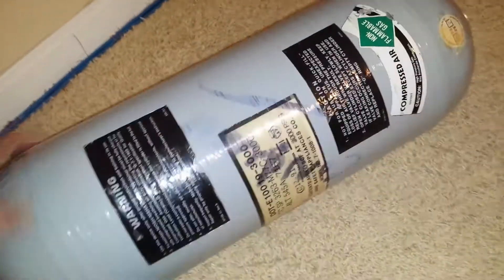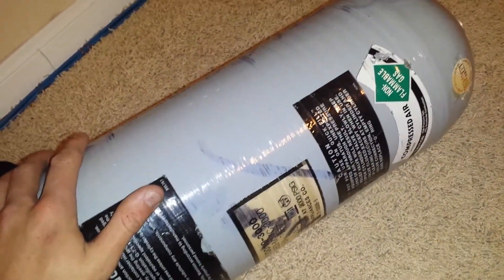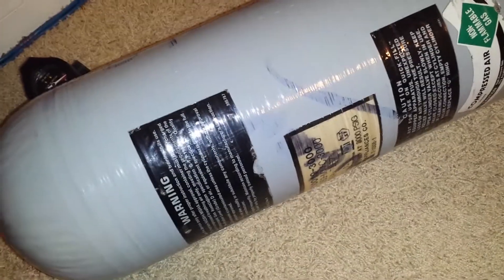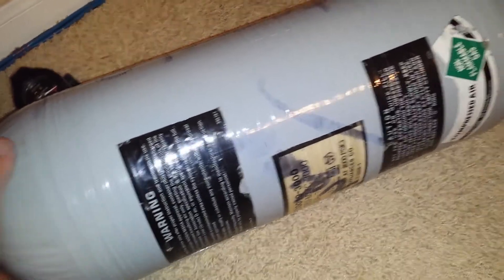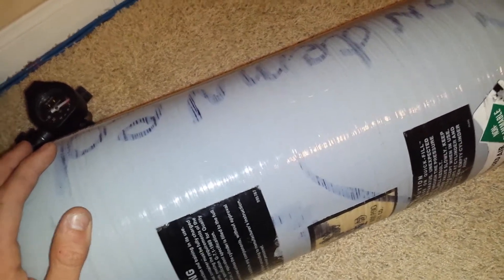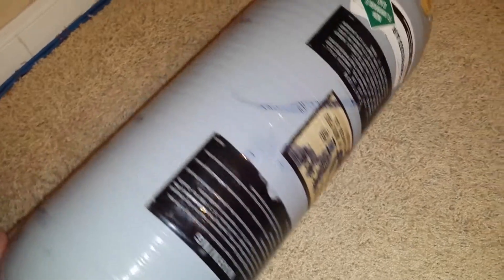If you're looking for an SCBA kit to buy, I do not recommend buying one that has a fiberglass tank that is out of its manufacturing date. The manufacturer's date says for fiberglass tanks it's a 15-year shelf life and it needs a three-year hydro. Aluminum tanks are pretty much unlimited, though the metal can harden and snap — but you're more likely to crash in an airliner than have an aluminum tank blow on you.